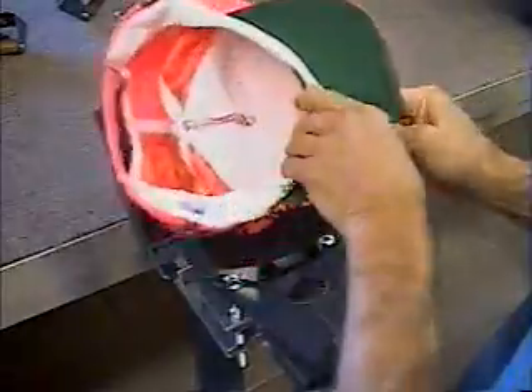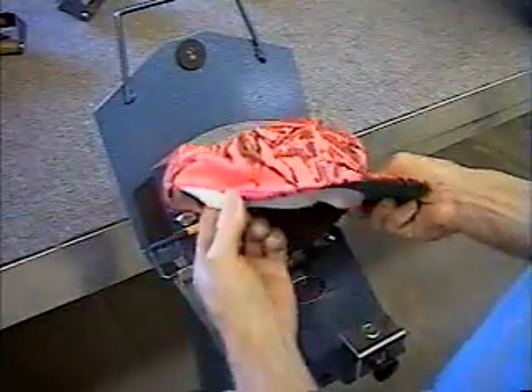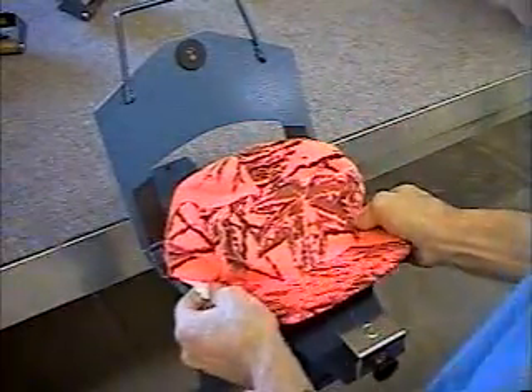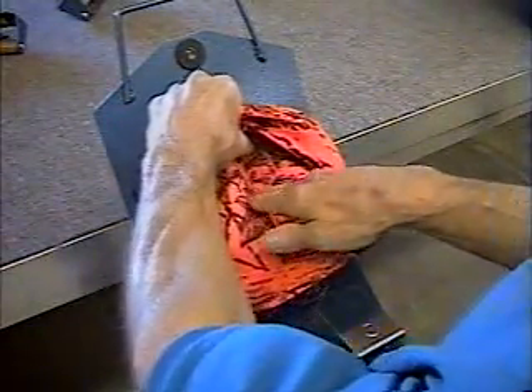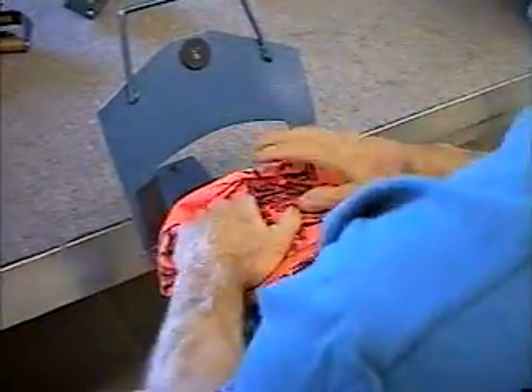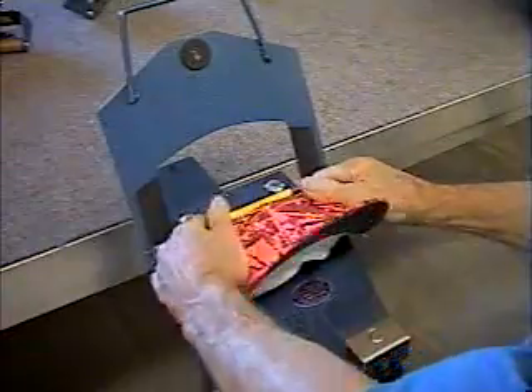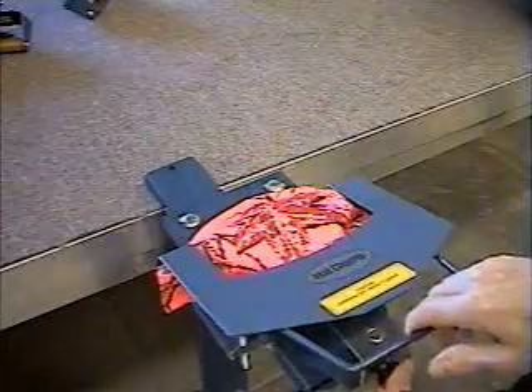Going over that again: bring the sweatband down, push the back of the points of the bill up against the aluminum stops, pull up on the button, push the sewn dimple area over the point, then pull up on the gripper bar. You're ready to print.